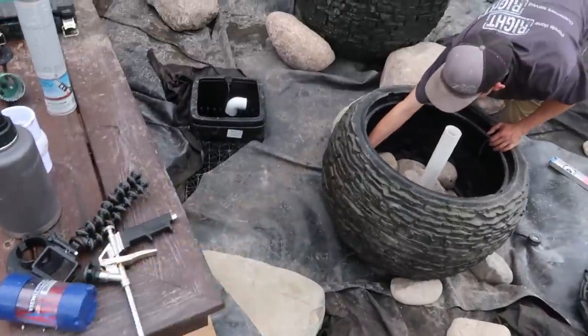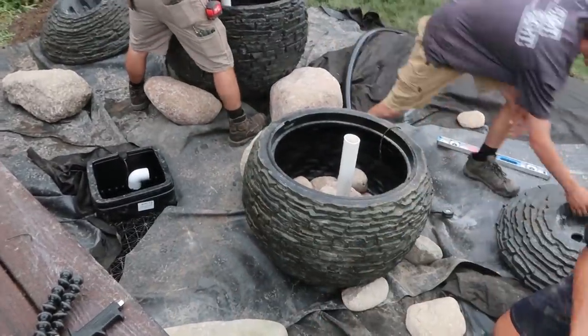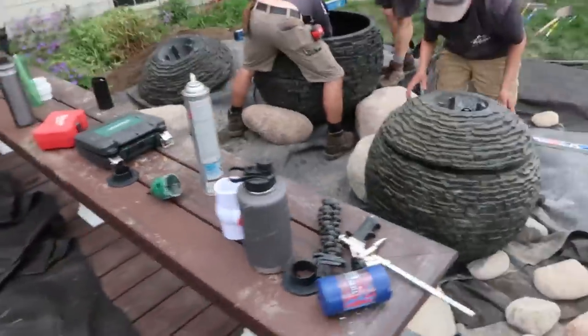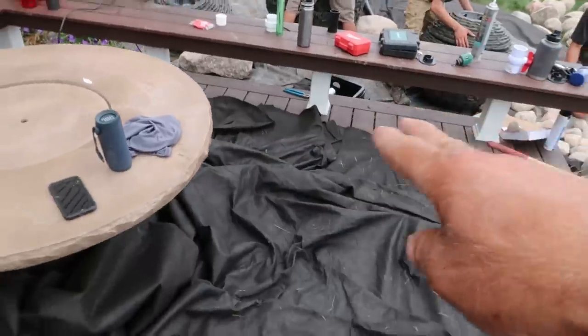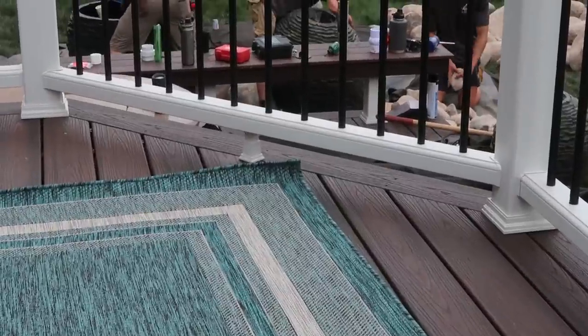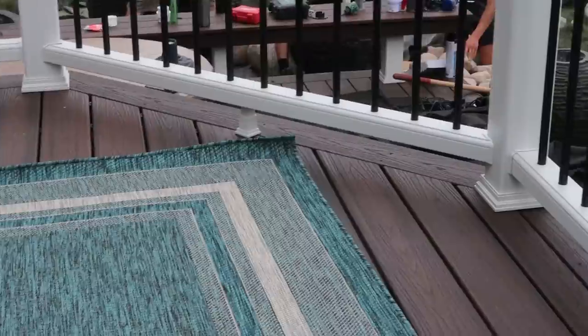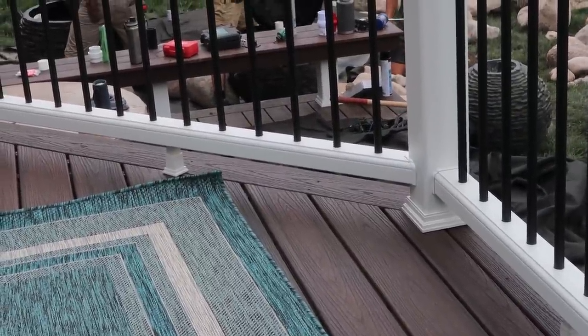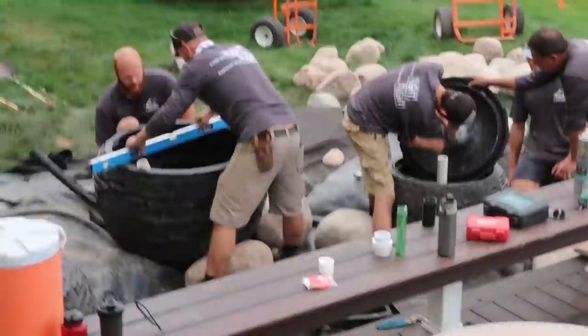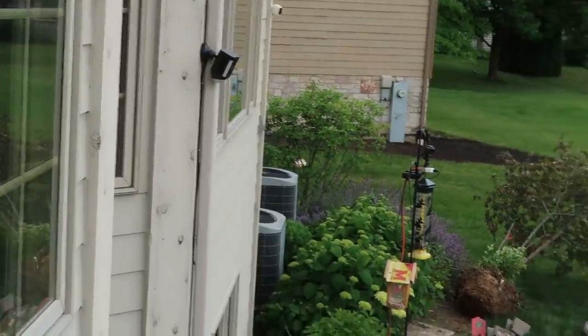You can see we put liner over top of the aqua blocks. Now we are going to do a bib liner over the top of the reservoir so we can pull that waterfall forward and get more of a stream effect coming down in front of that waterfall, giving it the illusion that the water is disappearing underneath the deck. From the viewing angle — there is going to be a love seat up here — I want to be able to see through the spindles underneath the bottom of that bench where Jack's leg is, and I want to see that waterfall and everything kind of disappearing down below that. So that little area from the top of the deck to the bottom of the bench, I still want to get a profile of that water as it comes down. Taking into account all the different viewing angles — we'll have a love seat over here, a high top table sitting right here, and all of the windows along the back side of the house looking down.